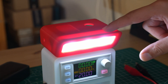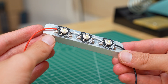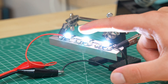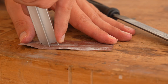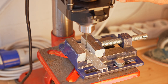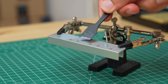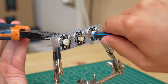In the lamp we are going to mount 3 LEDs, and to secure them I chose to use an aluminum profile which will also help dissipate heat. After cutting it to size I adapted it to fit into the 3D printed part. The LEDs are positioned on this profile using 2 screws each. Before securing them I put thermal paste under each LED, which helps conduct heat from the LEDs to the aluminum.